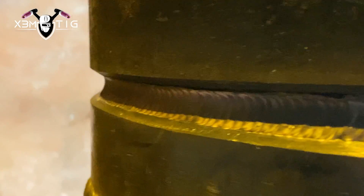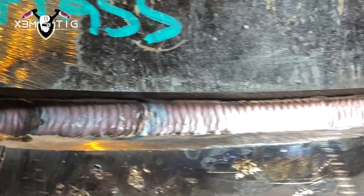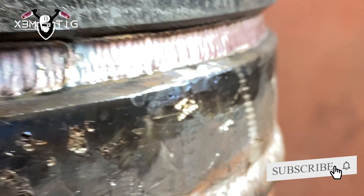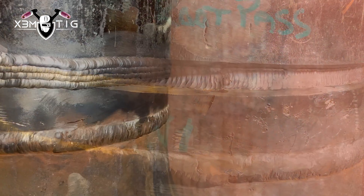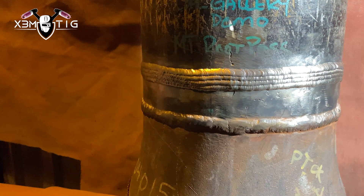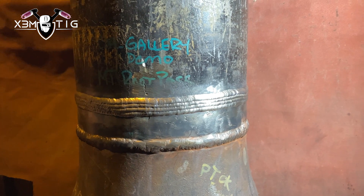There were no difficulties welding otherwise — you'd already see it in the puddle, which is good. The steam itself doesn't affect the weld if that worries you. If you encounter similar challenges down the road, apply this approach: preheat well, go slow, keep that heat zone in front of you, keep the surface hot so it doesn't turn to liquid and you avoid any porosity. This is the existing bottom pipe with lots of dents from dogs and the fit-up. The cap is about four passes and that should be good enough. Thanks for watching — hope this helps, see you in the next one, take care!